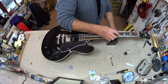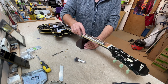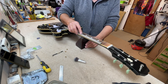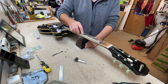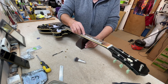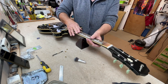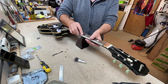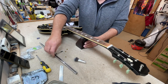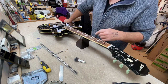What I'm trying to do is allow the curve of this flexible truss rod, or quite stiff truss rod actually, to, inverted commas, impose itself onto the underlying hills and valleys. So obviously, if it's got hills and valleys, I'm looking for it to take down the hills and bottom out the valleys, really. So the first bit of leveling I do tells me something straight away.